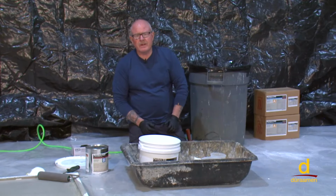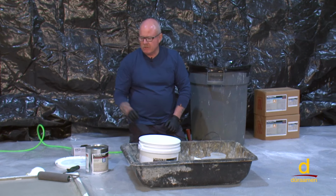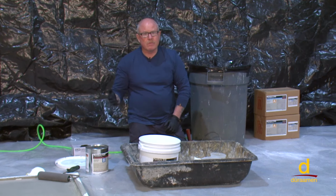On our Perdure 5500 self-leveling cement, we applied the A03 water-based acrylic, and roughly 2 to 3 hours has transpired, so it's dry, tack-free. Keep in mind, if it's working in the cooler months or in a damp environment, you may need to let the A03 dry a little longer, perhaps 4 or 5 hours.